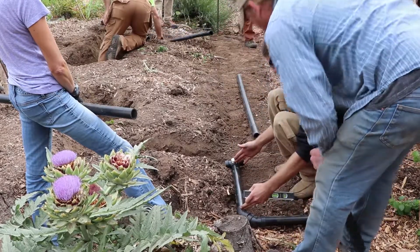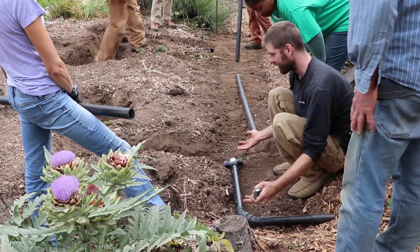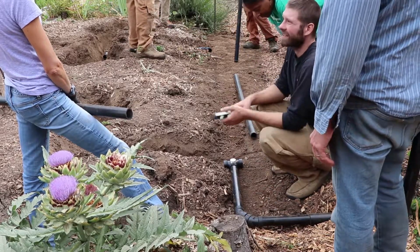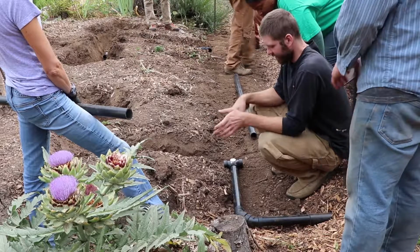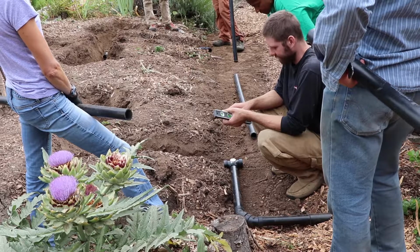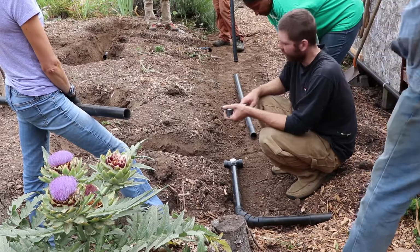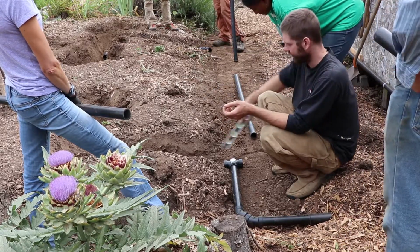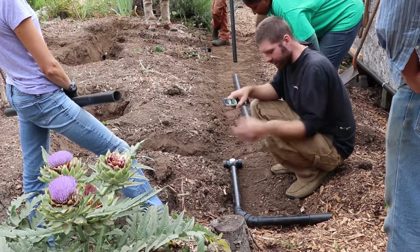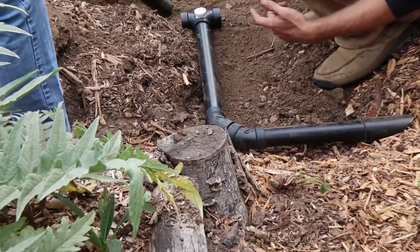And that's roughly 2 feet. Oh, wait, we want to have 2 feet for every flow splitter. Okay. Measure twice, cut once. You don't need two. Yeah, exactly. 18 inches is fine, which is about what this is, but at a minimum. So two feet from the house is your first one, but also 2 feet before each flow splitter. Yep. Okay. So, of straight pipe. Because otherwise there's turbulence and it won't split equally. It wants to travel around the outside of the pipe. And so then more would go here than here.